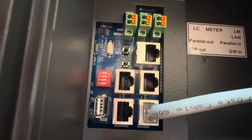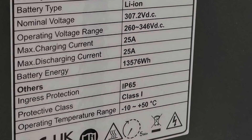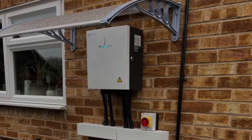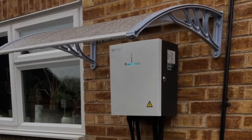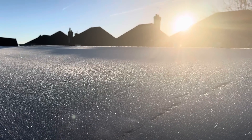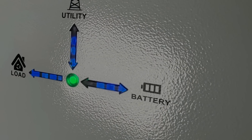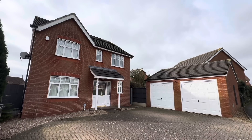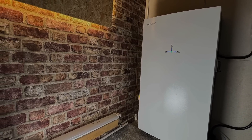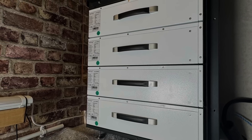The all-in-one has built-in Wi-Fi and can also connect directly into a modem. Both the all-in-one and the Give Gateway are IP65, so they can be installed outside, but GivEnergy do recommend they should be installed with a canopy to protect from snow and frost. Like all battery systems, if the temperature drops, so will the efficiency of the battery, so it's important to discuss location with the customer. The technology in the unit will throttle back power automatically when it gets cold, which will ultimately prolong the life of the battery.